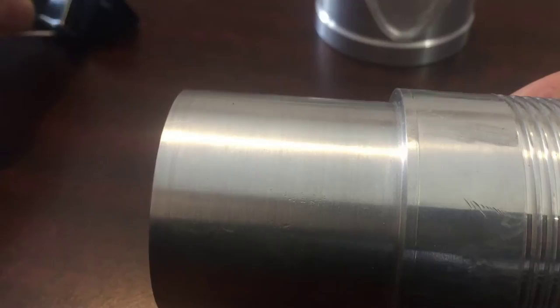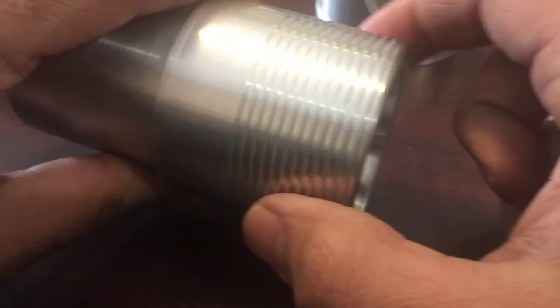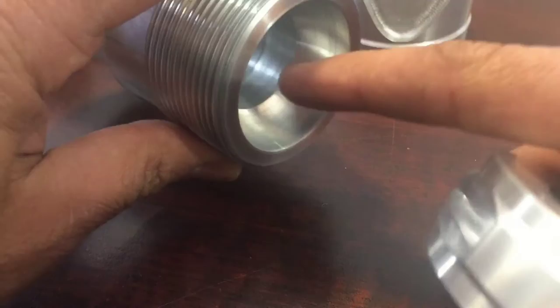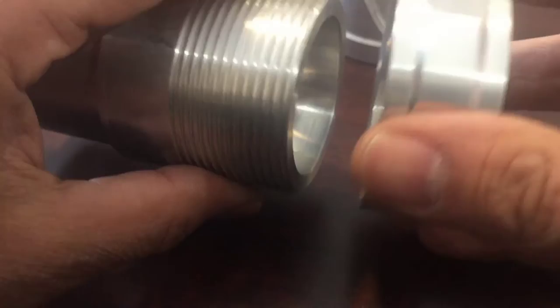All around you cannot feel any seam at all, and the dimensions are good too. Just to show you what I have here: this diameter is just to hold in the chuck, and this is the thread portion. For a two-inch ball you could make it two-and-a-half-inch external thread and the same internally. Depending on your ball or sphere size, you can go any size — this diameter here is about one inch, so scale accordingly.